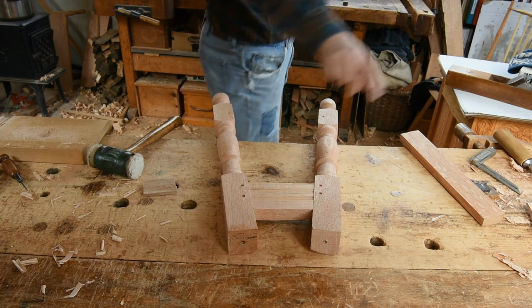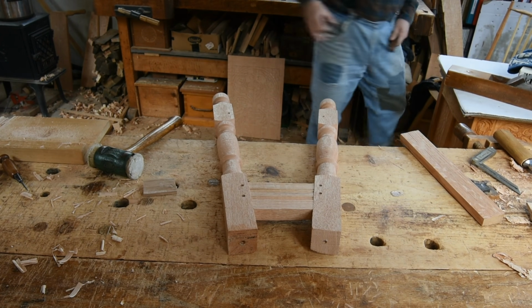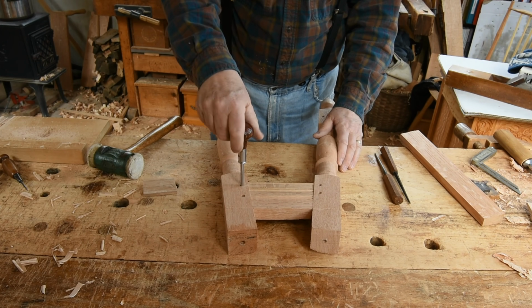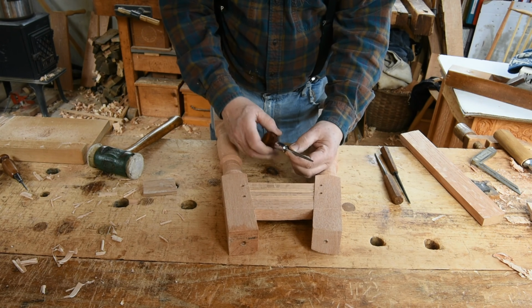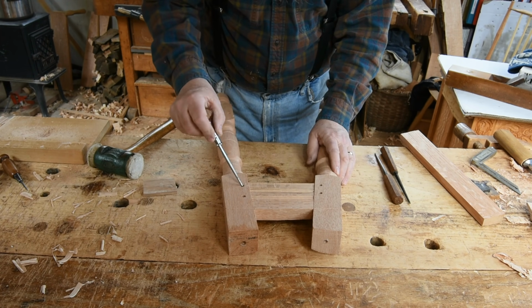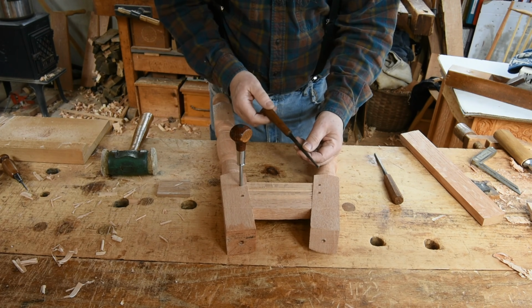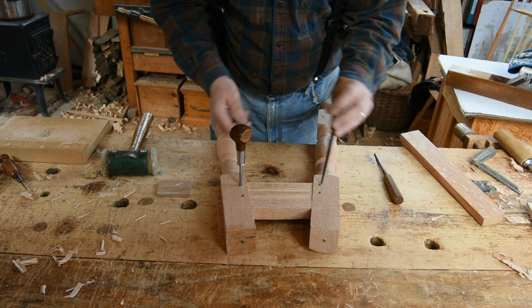But formerly, I used to use these, had to run and get them. You can put a temporary pin in to hold that in place. This one is just a crummy awl. For an awl, I don't like it. It's too stout, it's too blunt. You can always regrind the point, but for what we call a drawbore pin, it's fine. Jenny Alexander used to make them out of alignment pins that she would then put a wooden handle on.